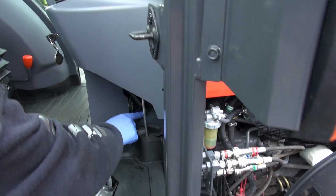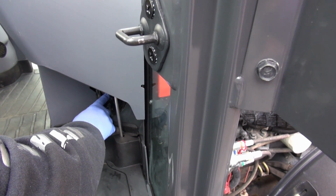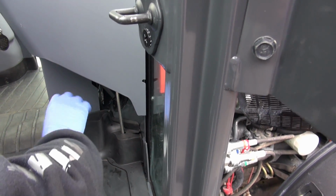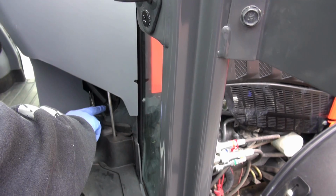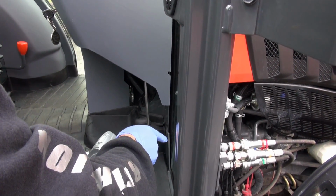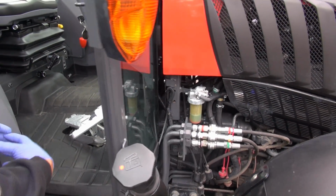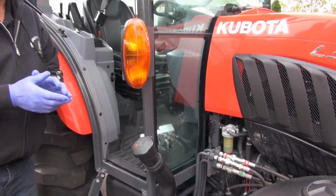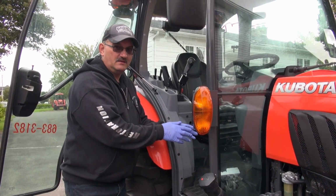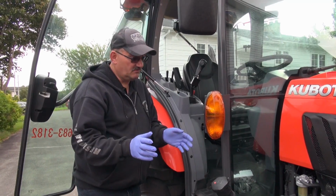When they installed this grommet dry at the factory, it starts to dig into the shaft itself, and it starts to spin. And when it starts to spin, this clip gets hooked up, this boot drops down outside on the steering shaft, and you have basically a 3-inch, 4-inch hole in your cab. Sometimes you might feel a bit of a draft coming in on your right foot. Look for that.